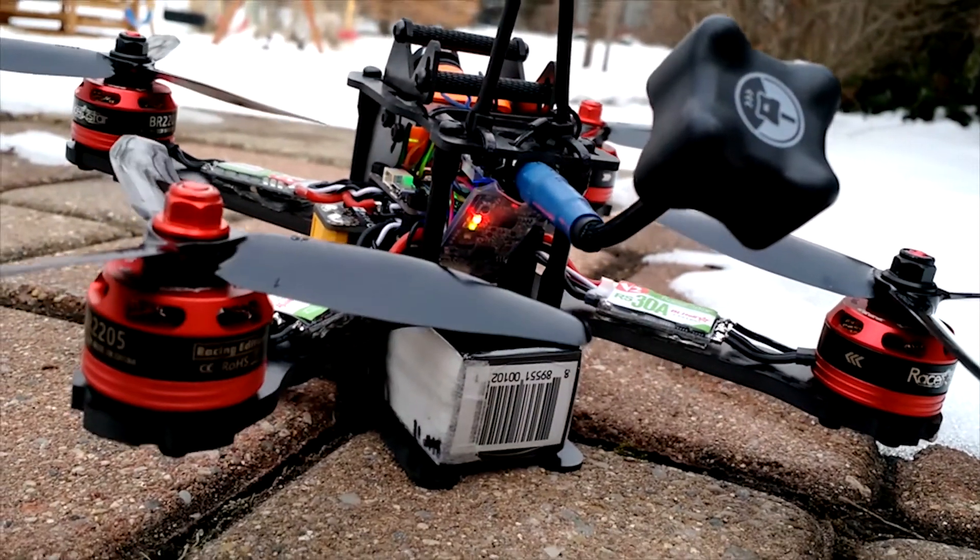First and foremost I had a little bit of an issue with power. I was able to do the build and do my maiden flight and everything seemed to work fine. However, soon after, when I went to fly it again, it seemed to just turn itself off and reboot. One time I was doing a hover test and it actually fell out of the sky and rebooted on me. What I think it ended up being is that the 5-volt regulator built into the Revo that comes with it is really not that good. You can power the flight controller with it, but if you try to power anything else it might just overheat. That's why it actually worked on the maiden flight — flying through the air was cooling off the voltage regulator — and that's how I was able to power both my flight controller and my receiver, which were the only two things I was running on the 5 volts.